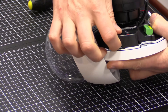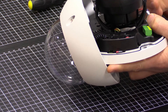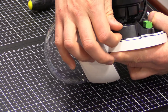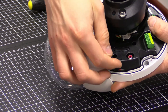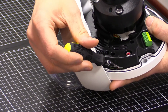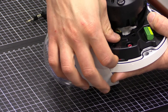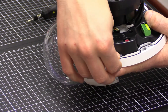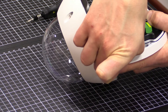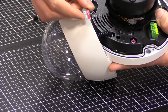To remove the card, it can sometimes be a little tricky — push again and it will pop out. Make sure that when you've got the card in, it is actually engaged and not just sitting there. You must feel a positive click and there must be no overlap. If you're failing to close the dome with the SD card installed, it's probably not pushed in correctly. If you grab it on the edges with your fingernails, you can remove the SD card.